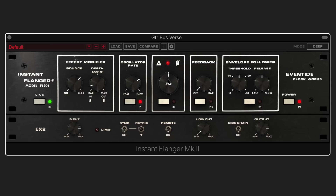We can optionally manually control it with the manual knob. When it's all the way down, that's like setting the bucket brigades to their longest delay time, and when we dial it up it's the shortest delay time, so we get a really dramatic effect up high. With Feedback we'll hear it more pronounced. We can go fast or slow. And this will invert the feedback — you hear a lot of nulls and cancellations there. Very dramatic effect.